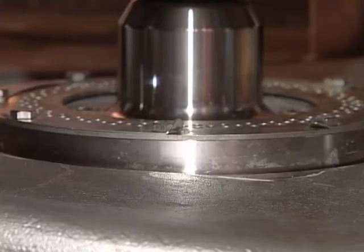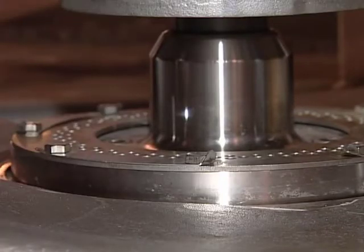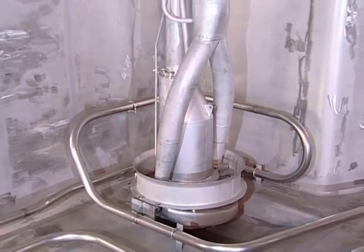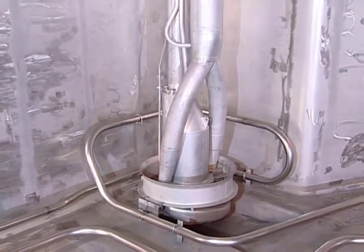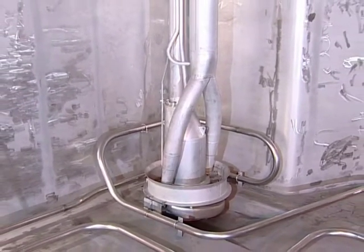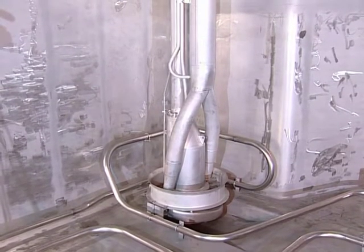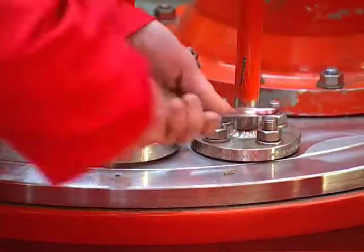Use new locking plates to secure the bolts for the upper and lower wear ring support. Sequence number 6: Pressure testing and test running. After assembly, visually check the cargo pump and the cargo tank. No rags or other components must be left in the cargo tank. Pressure test the cargo pump's cofferdam with 3 bar pressure.